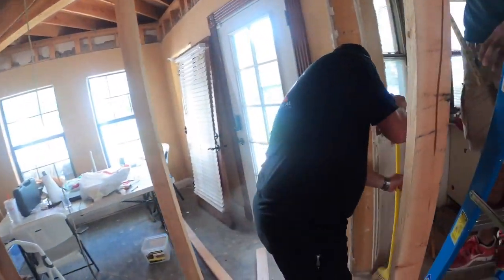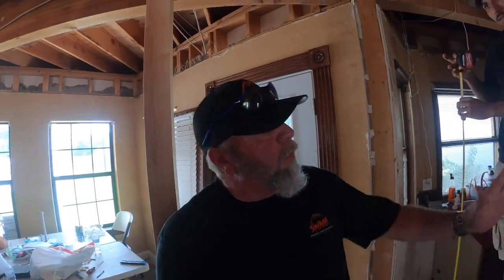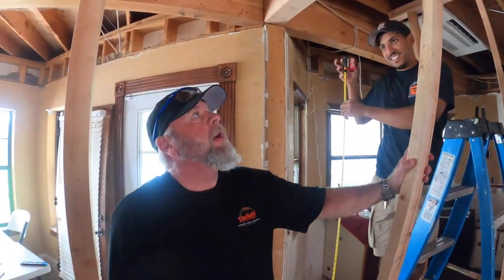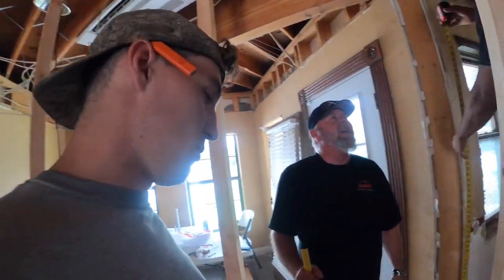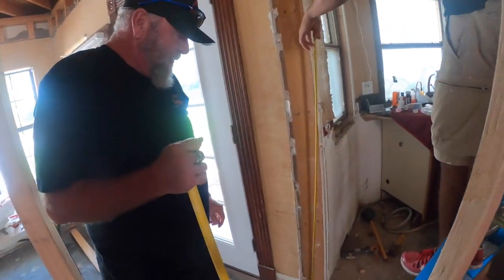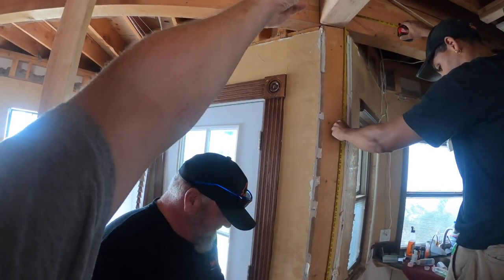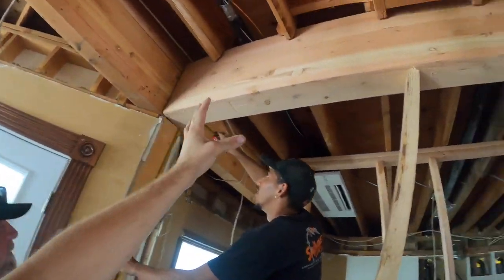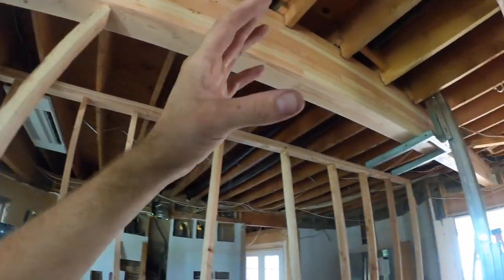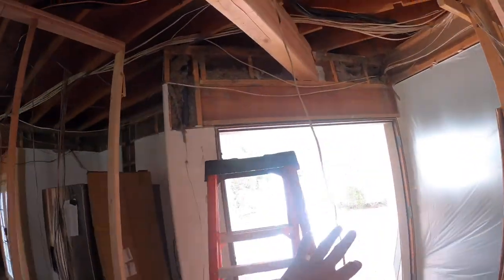The board just looks a little crooked, so we're going to turn this over to Christian. What's going on here is that we're prying this into position. We're going to measure for our post that's going right here — the post is going to go right up in there to hold this side. Once this side is held and supported by a four-by-six, we're going to move the material lift closer to this side and crank it up into position, and then it'll be 100% load bearing.